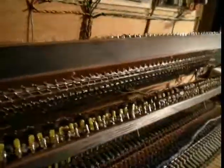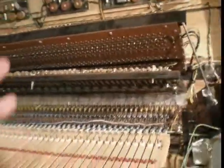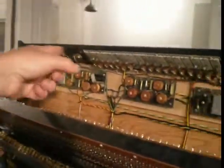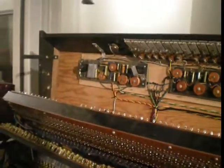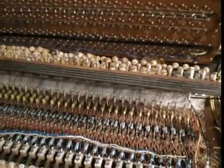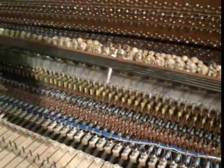The very top layer there — there's another layer below here which you will find very similar to the other one. So this is for the four-foot and this is for the eight-foot down here. And two independent outputs — I found one for the eight and one for the four-foot, which confused me greatly at first. These are wired differently; that one is actually just used as a kill-to-ground kind of thing — it damps to ground as you turn the resistance down, taking away your signal on that one. The trouble's gonna be in those capacitors, probably, or leaky diodes, typically found in this type of circuit.